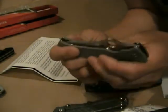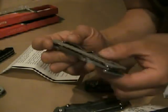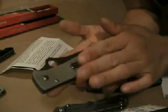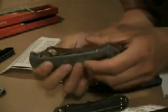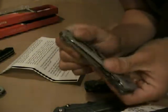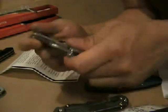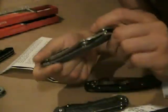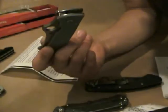You want to reach a point of centering that you like, and then slowly tighten up the handle without affecting that, without applying more pressure on the handles to pull the blade around. Basically, if you screw too tight, it'll squeeze in some direction and it'll move the blade. That's basically what you can do if you were to push and pull the top part, slide them like this, or twist it like this. It can move things around, and that's what you're trying to avoid. You're trying to get a balance. But regardless, bear that in mind.